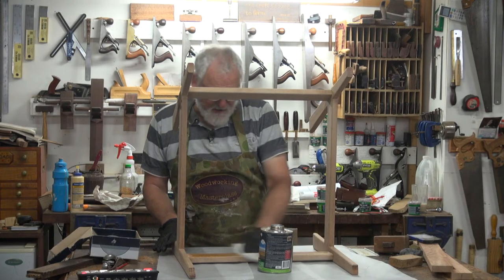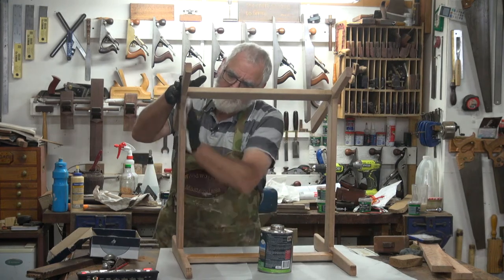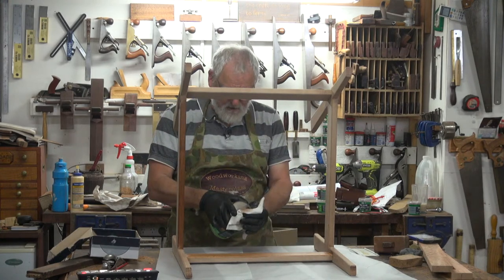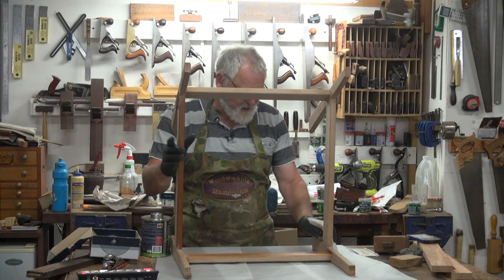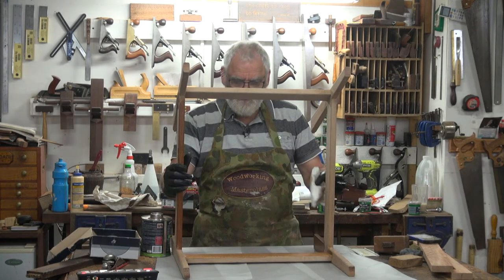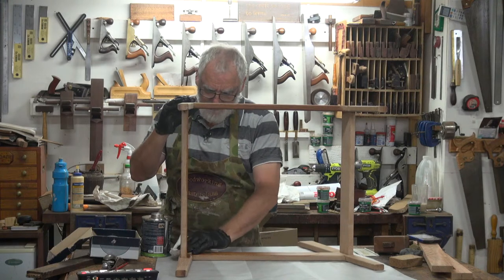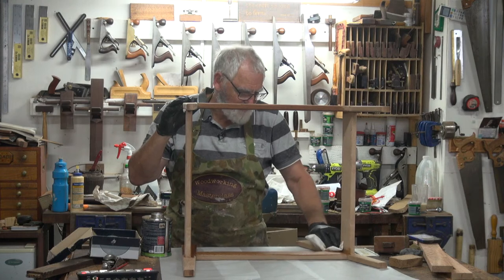If you're going to spray it, make it a light spray. If you're going to oil it, just put oil on it. And then you can get the colour. Or worst case scenario, get a scrap bit of the timber that you're going to be using and put whatever your finish is on that, and then hold that up against your job and colour match any putty you use to go with that sample.